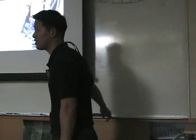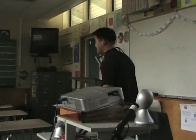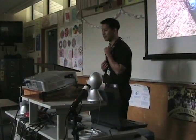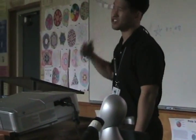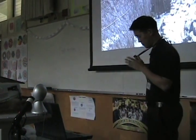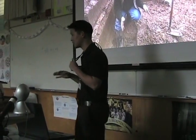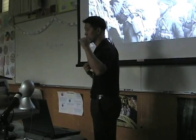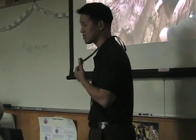One thing you want to be careful of is if the audio is playing too loud and you have your microphone near the speaker, the audio from the speaker is going here, and you're going to hear a bad screech. It's just feedback. So just be careful of that. Also be careful if you leave this on and put it on the table, and some kids are talking or you have audio playing through it, sometimes people forget to turn this off. So if you do notice that your audio is going up and down, like turning off and on, it's probably because this is on.